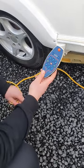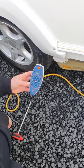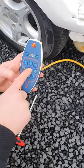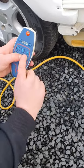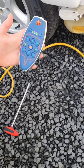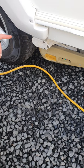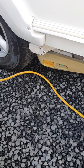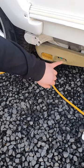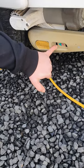This is your motor mover remote. Push and hold the on button and it'll flash up then flash back down. When you want to engage it onto your wheels, press and hold the button in the middle with the wheel on it, then press the arrow pointing towards the top of the remote. Press and release them — the lights at the top will start to flash and count down from four to one. You'll then hear the motor mover start to move and engage itself onto the wheel. It does this on both sides at the same time. There is a wee yellow indicator that appears in the small window so you know the motor mover has locked on correctly.